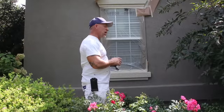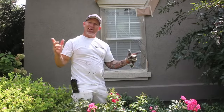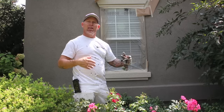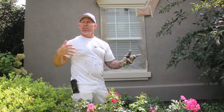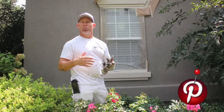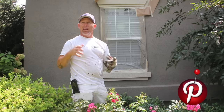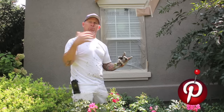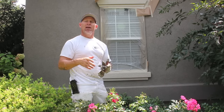It's a good idea to watch the spray process when I'm spraying this stucco trim. I'm actually using an extension that will give me a lot more reach to do the windows — you're going to see me on an extension ladder reaching a lot farther with that extension. I'm also shooting at multiple angles because the stucco has a lot of ins and outs and crevices, and you can't just spray it one direction — you've got to spray it multiple directions. Watch my technique as I'm actually spraying that stucco.